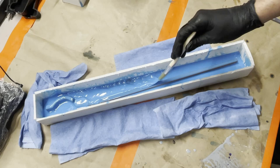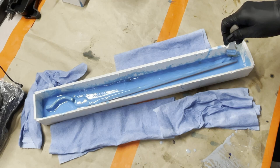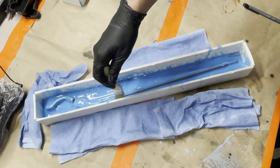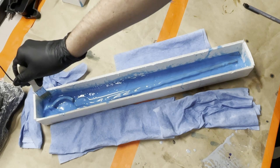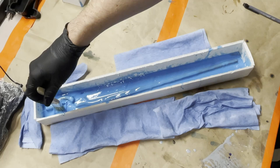I had a mold that was just a junk test mold, and I was testing some new silicone, and it was full of bubbles. I pressure cast the little part, and it basically came out looking like a punk rock casting, because it had these little spikes all over it where the resin had gotten basically not sucked but pushed into all the little air bubbles. You couldn't actually see the air bubbles when you looked at the mold because it just looked like a fine solid surface, but the pressure pushed the silicone and it basically pierced all those little bubbles and went into the silicone.